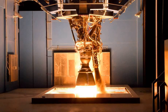At full power, the Merlin vacuum engine operates with the greatest efficiency ever for an American-made hydrocarbon rocket engine. Shortly before the scheduled second flight of the Falcon 9, two cracks were discovered in the 2.7-meter long niobium alloy sheet nozzle. The engineering solution was to cut off the lower 1.2 meters of the nozzle and launch two days later, as the extra performance from the longer nozzle was not necessary to meet the mission objectives. Even with the shortened nozzle, the engine placed the second stage into an orbit of 11,000 km altitude.